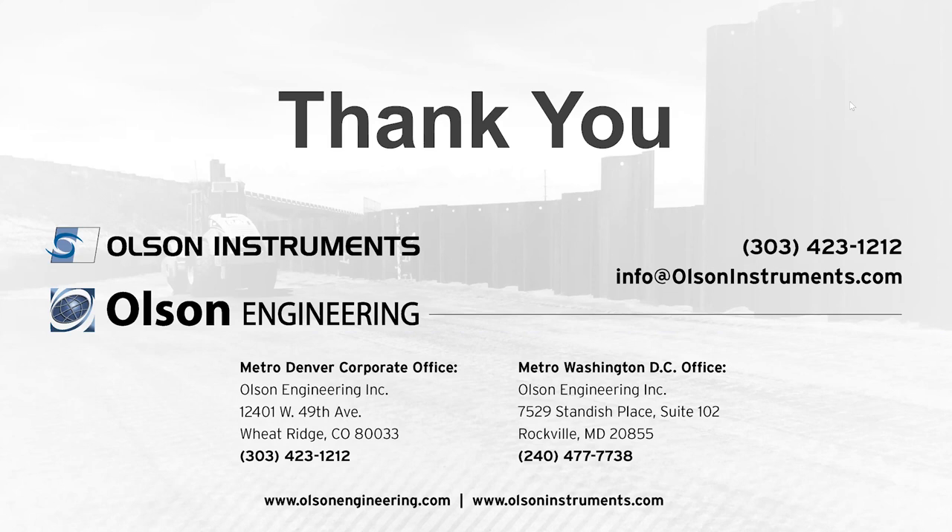Professor Mitra at Oklahoma State University was awarded a grant by the Interlocking Concrete Pavement Institute to look at very coarse drain rock — similar to railroad ballast used under their pavements — to check compaction using an LWD approach. We have a consulting role supporting him, and he's just starting that research recently. He's also going to explore a larger diameter mold, normally 12 inches in diameter.